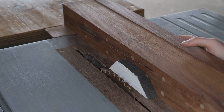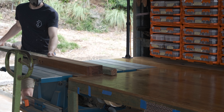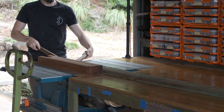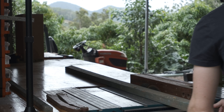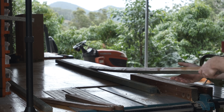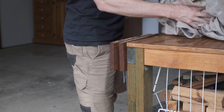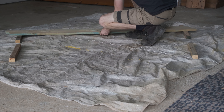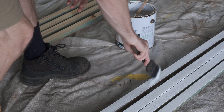I'm using a previous batten to space the rip cut because I know it will give me four equal battens from a single stud. I keep my push sticks on a magnet next to my table saw so in moments like this when I forget to grab them I'm not caught out. Cutting up these studs can release some stress in the wood and make them bow a little, but most of them will be cut down small enough that this won't matter. With the battens all cut up I'm covering them in some exterior enamel paint — about three coats to make sure they were fully protected.